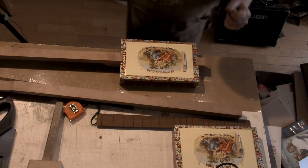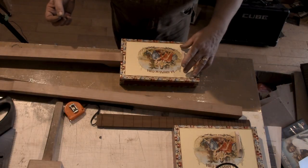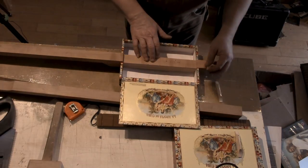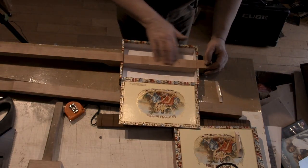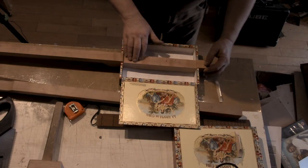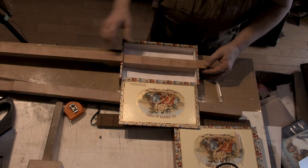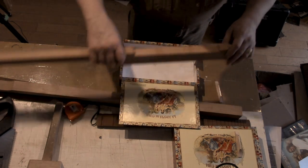The pressure of the strings on the bridge is transmitted through the top into the neck stick. That gives a very lively guitar — great for electrics, great for a pure strong tone and plenty of sustain. Some people think you should move the top of the neck stick away from the top of the box to allow the top to resonate. I used to do that.